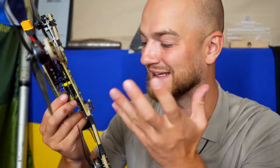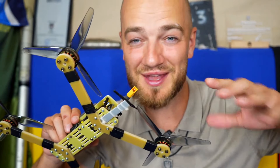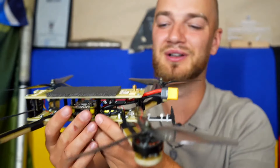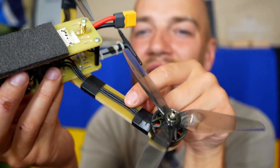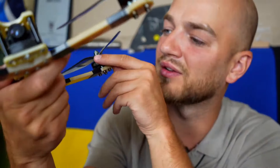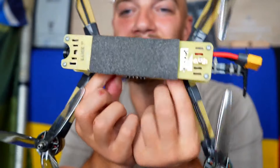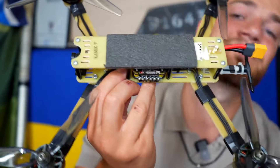I'll show you one final thing — a bonus surprise. This was actually sent to the front; it's made by a company and sold to the Ukrainian Armed Forces. Don't forget, all these other drones I've shown you cost double if not triple what we're putting out there. Plastic frame, as you can see — complete flex — so you put any weight on this at all and the whole drone's flying profile is completely unhinged. The motors are too small, the wires are too small, so these can actually overheat and burn through, melting the wires. They do have a Rush Max with the fan, but the rest of it's not good. You can probably see from there the quality of the soldering.